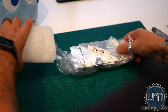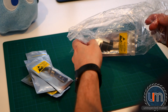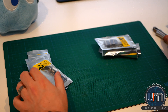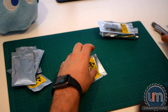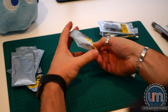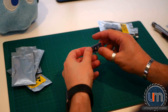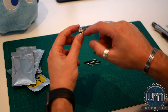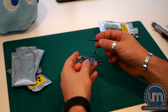Let's see if we can just pull it out. We've got two different types of boards in here. The first one, as you've already seen in a previous video — these are Arduino Nano compatible boards using the ATmega328p microcontroller chip at 16 megahertz. I believe they're 5 volt boards, not 3.3 volt. These particular ones came with separate headers.